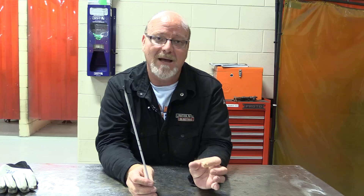If you take the time to learn that pad really well, all the rest of your welds will go much faster and easier. It's tedious, but that's where we all start. The 7018 is a very strong, smooth electrode that produces very nice looking welds. When you compare the 6010 to the 7018, the 6010 looks very rough — that's the electrode, not just you. We use the 7018 in combination with the 6010, and those are the two most common electrodes in industry. Learn the differences, talk to your instructor, and get in there and make some welds.